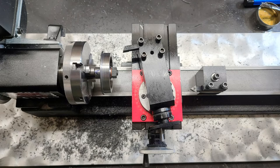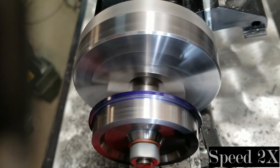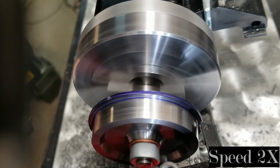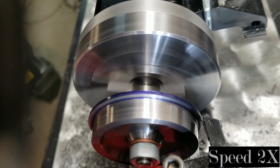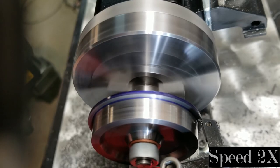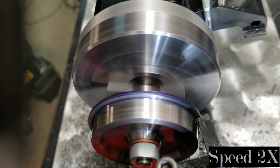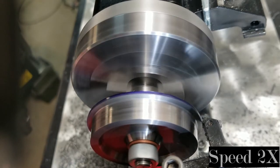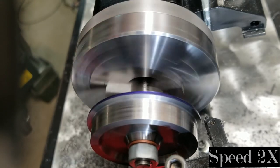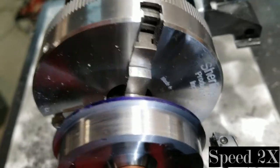It does work — it gets in there to do the job. Now I'm going to begin machining the 10 degrees on the flange. I'll do about half of it first — actually that was a little more than half — so I'm going to bring it in and really get it into that corner. Remove where it takes the blue Dykem off and put that 10 degrees in. Good — it's doing it now. I've got that 10 degrees machined in there and it looks nice. Not a trace of blue Dykem left, and I didn't take much off the tread on the flange.